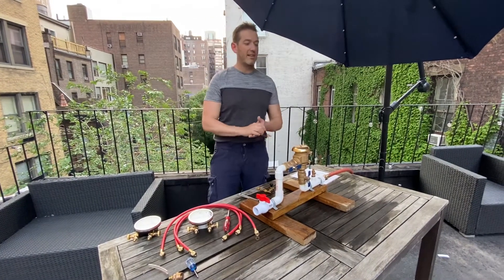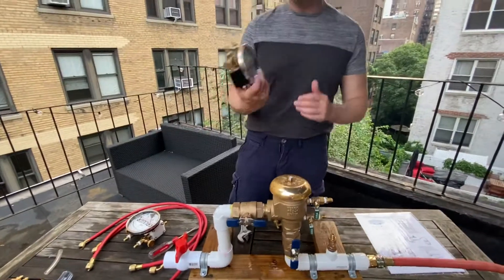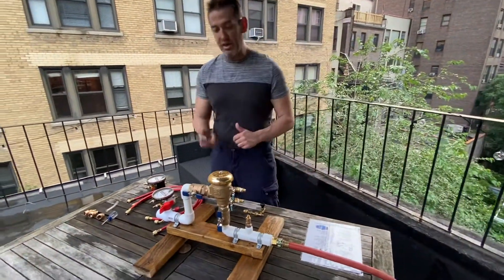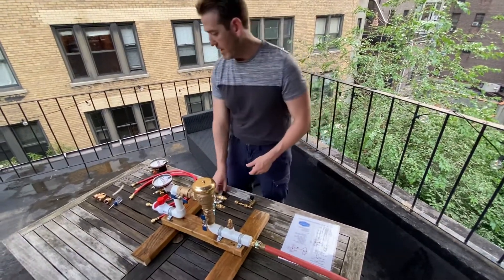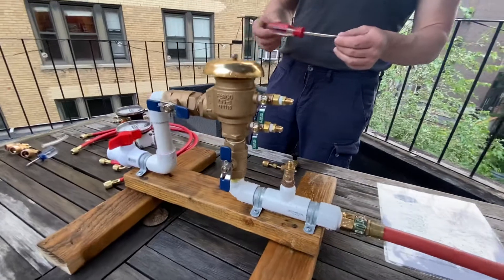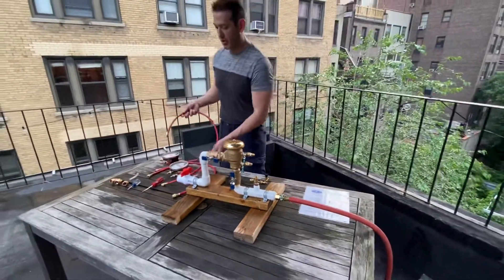In this video we're going to show you how to test an ASSE 1020 pressure vacuum breaker using the USC 10th edition and a two-valve kit. We are using the Kruger Instruments TK2. You're also going to need a bleed-off tee for the USC procedures, a crescent wrench or a Phillips screwdriver depending on what kind of canopy you have, and depending on the kind of test cocks — you might have a flathead screwdriver-activated test cocks. It's a one-hose test, so you're only going to need one hose.